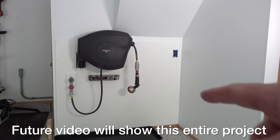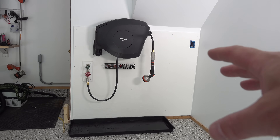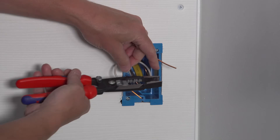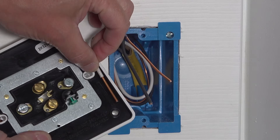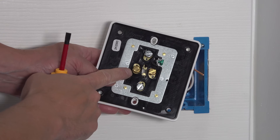I've been building a brand new wash and detailing station in my garage and I wanted to have a solid heavy duty electric outlet. Because this is a new install, I've got my wires there — the hot, the neutral, and the ground. You're actually going to strip quite a bit more wire. I use the built-in strip gauge and remove about an inch of insulation. Additionally, you'll notice I've got two different sets of screws.